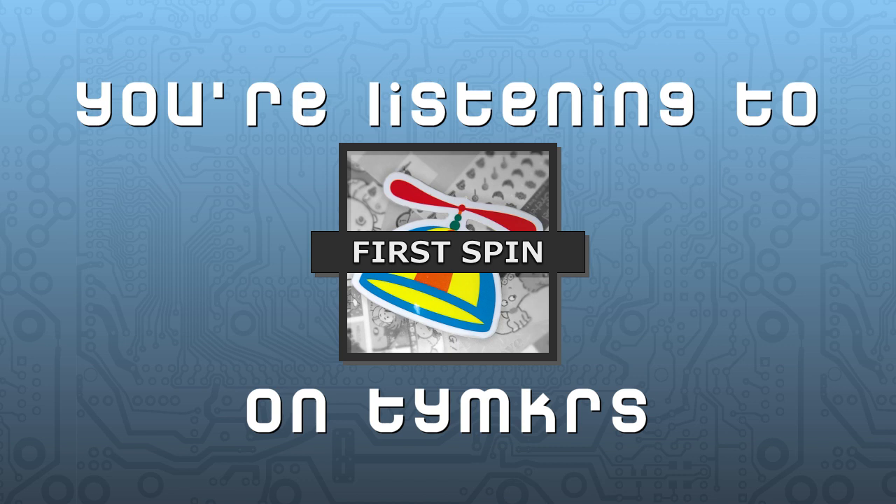As a practical example: a lot of your recent programs have had those four or five I2C functions that you've been copying into each one. You could have taken those — the read, write, start, and stop functions — made a single file, included it as an object, and just called it by 'object name dot read' or 'object name dot write'. That's essentially what the I2C driver object does.